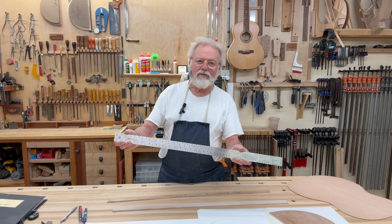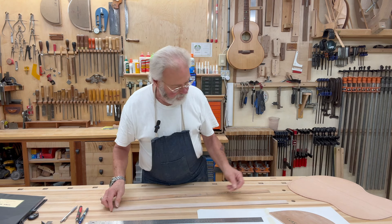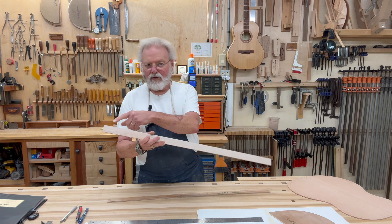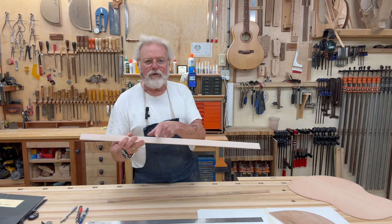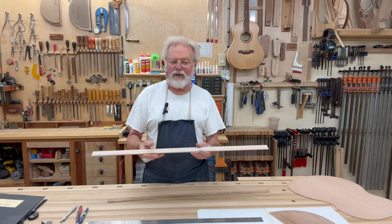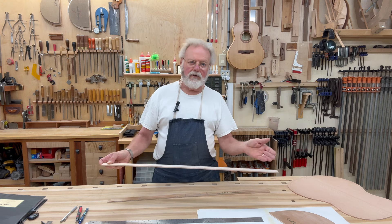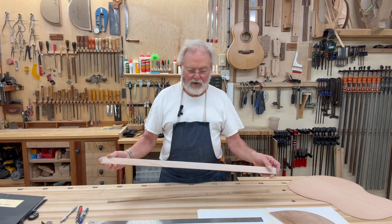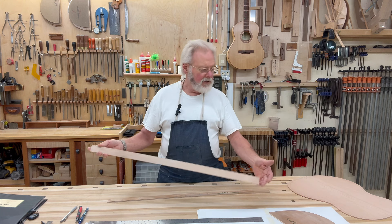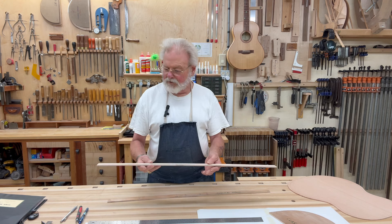You could make a story stick from one of these, but I can understand that seems a little pointless. A story stick is nothing but a stick with critical markings on it that show you points that you want to hit each and every time you lay it down, so that you can use it to lay out your guitar or check certain features. This can be used on your paper layout as well as when you mark out your top.